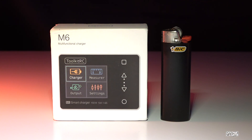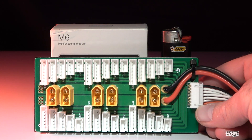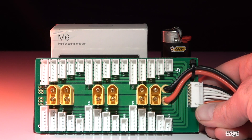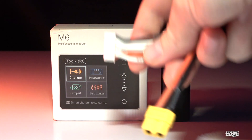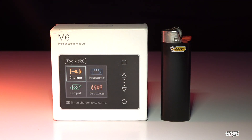It also has an XT60 on here to plug in. Whoop season is coming up, so it's time to find some type of charge option out on the road. This is the other option for your bigger batteries — the XT60 parallel board — and this one will do up to 6S. It has balance connectors from 2 to 6S and your balance lead and XT60.